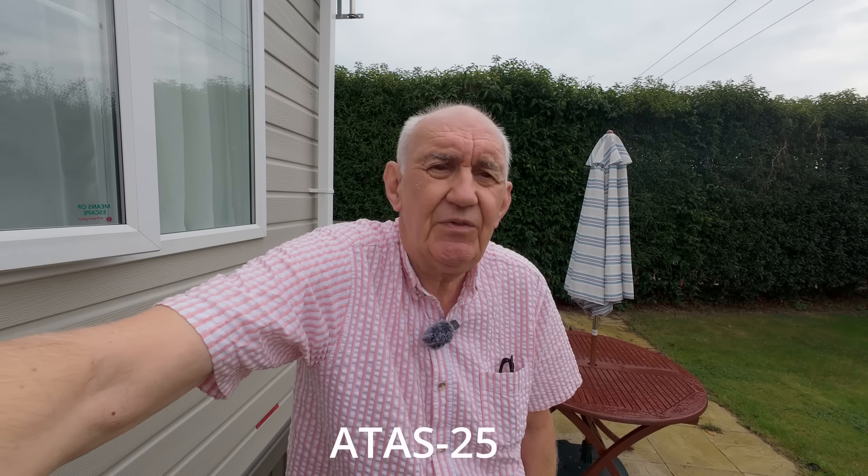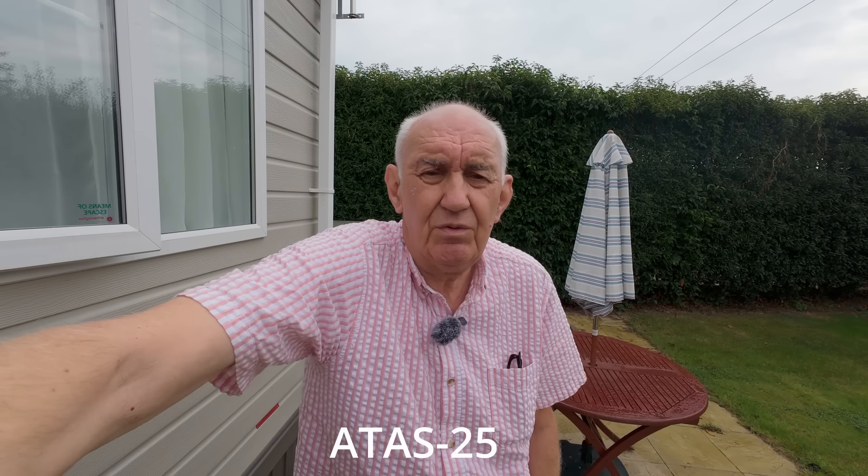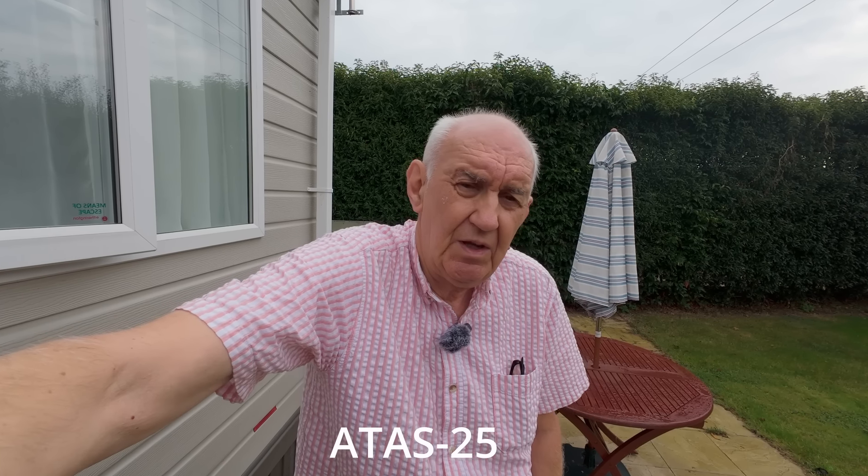The aerial I'm going to discuss and demonstrate today is the Yaesu ATAS25. It's a manually tuned antenna that covers 40 meters through to 70 centimeters and it's variable frequency. You can adjust the antenna to basically whatever you like in that part of the spectrum, or at least to 50 megahertz, and then on two meters and 70 centimeters it's slightly different. It's a handy antenna to go out portable with — you can stick it on the ground, on the balcony or patio, and provided you've got some sort of radial system, it seems to work quite well.